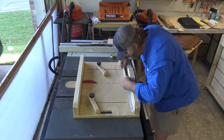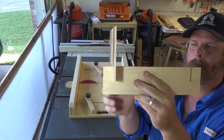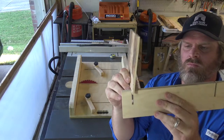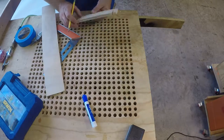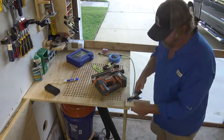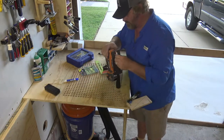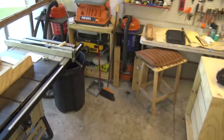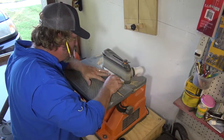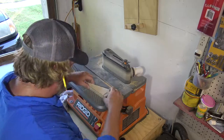Now I'm going to mark the 45-degree cut and do this with the jigsaw. If I was making a production run I'd set up a jig on the bandsaw, but since we're just making two I'll just zip it through. Then I'll run over to the sander and sand them both to the same height, round over the front edge — that will bring it to seven and a quarter — and give it a quick sand.